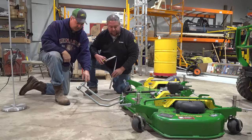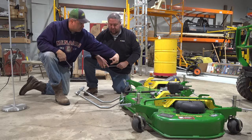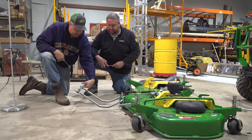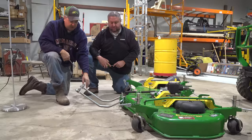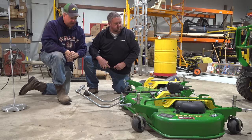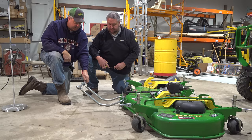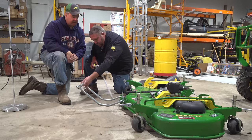But I would say the symptom is if this is too low, those front, you might say, fork connectors will go above this thing and push it down. Yep. They need to come in like this. They need to come in and lift it up. And so when you're driving in, you can actually see that from the tractor. When you're driving in, if this fork on the quick connector there doesn't fit, then you're going to have to raise this a little higher. You are. But 11.5 inches, it looks like even when I give it a good yank, I'm below 11. Yeah, that's 10.5 or something.